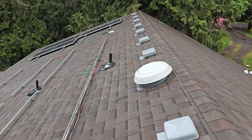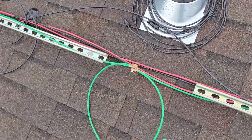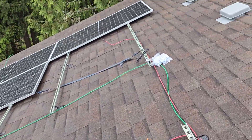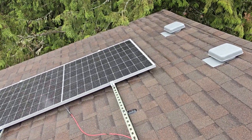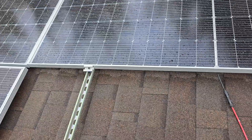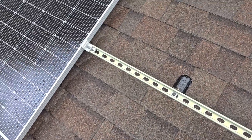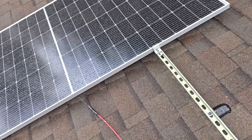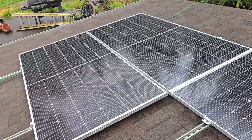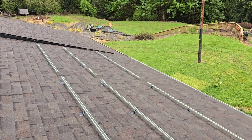This is where I'm going to tie all the unistruts to ground them out using a big bug nut. Those T-clamp pieces — the ones you get on Amazon — they don't fit in this unistrut even though the listing says they're the right size. So before you get up here thinking you have everything ready to go, get up there first and make sure everything fits.